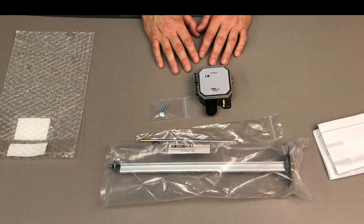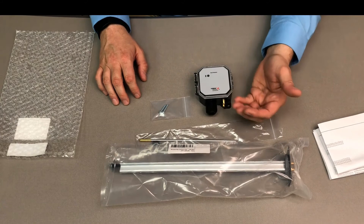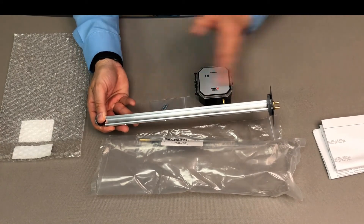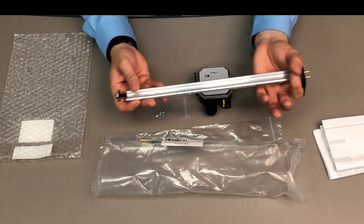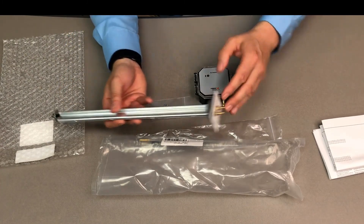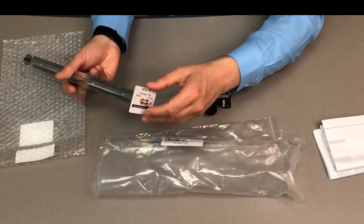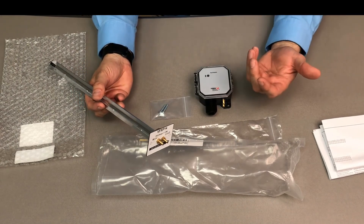There's the PX3 portion. We also talked about the velocity mode. For instance, when you want a velocity configuration, you'd also use the VFXP series pitot tubes. There are five different tube variants available based on different lengths. This is the longest one we offer, which is the 14-inch probe. You mount this from the outside of the duct into the duct and then connect it into the other side. The shorter probes don't have the second screw terminal, so you only have to mount from one position. You connect hoses here to the panel portion, configured for velocity panel, and then you put this PX3 divisor offset into the control to give you the velocity reading you've selected.